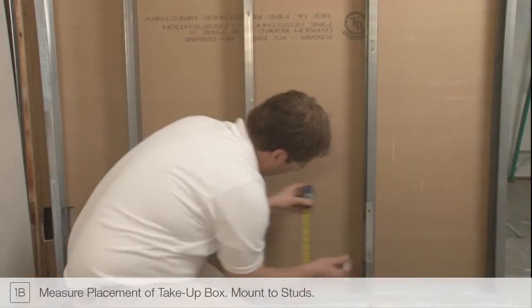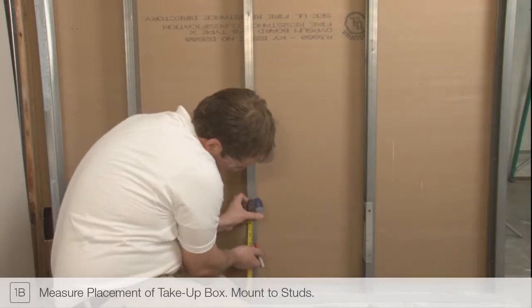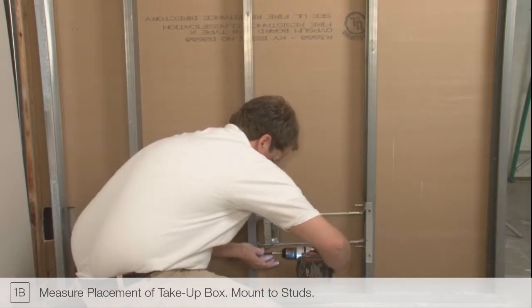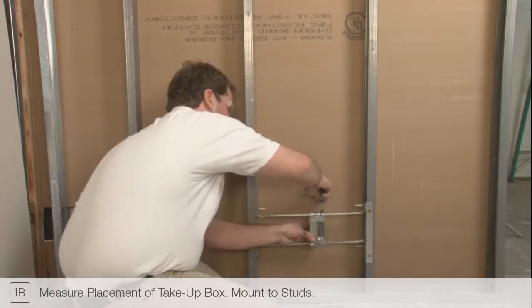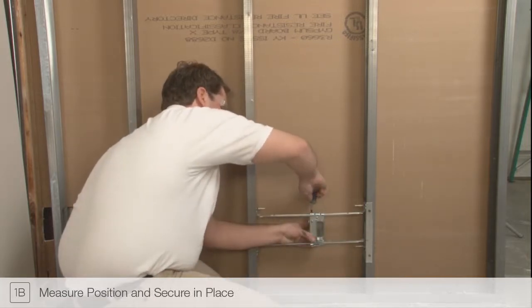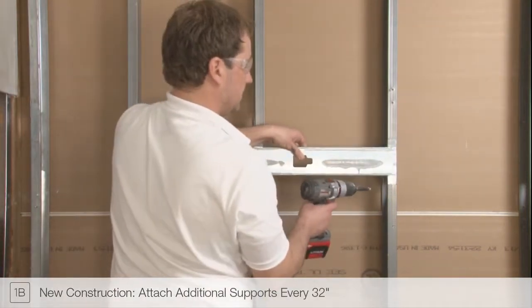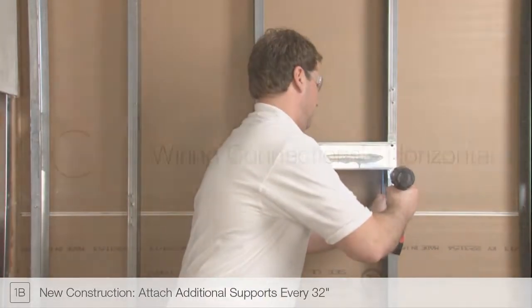At the opposite end of the Truline run, mount the excess soft strip box. This will be used to accommodate any extra LEDs. Add supporting crossbars every few feet. This will provide structural support to anchor the Truline channel.